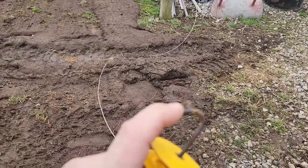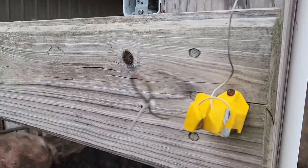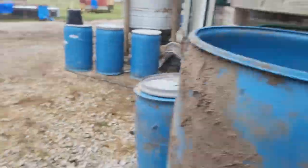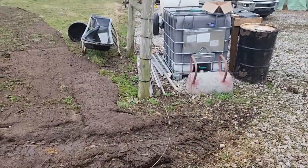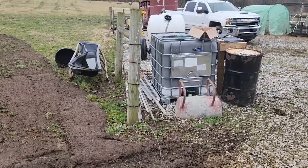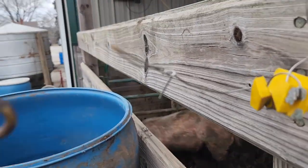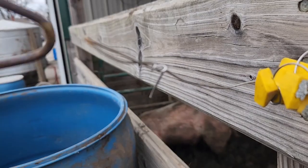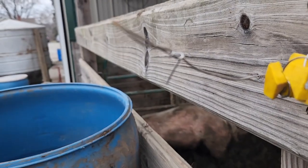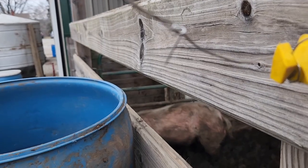Basically, this right here is a ground. This is your hot side. So when you touch them together, you get a spark. If you got a short this way, or you're grounded somewhere that way, you can take at the source, hold it up against it, and if you get a big arc, you know you got a short that direction. If you don't, you're probably pretty safe going that way.